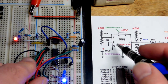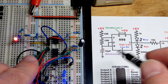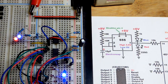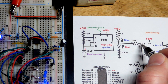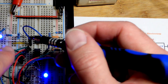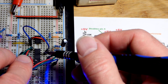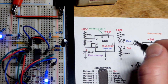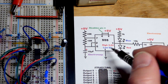For our clock signal we have the 555 timer wired in astable mode — that's been covered in my other videos so we'll just briefly mention it. One of my 4017s didn't work when I had the 555 output directly to the clock pin, so I added a 10k resistor to help protect it. The output goes through a 10k resistor down to a blank row, then a jumper to the clock pin — pin 14 of the 4017.